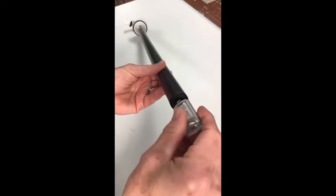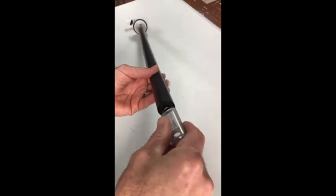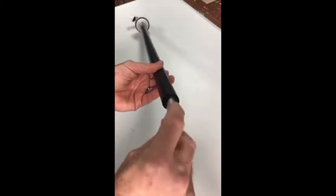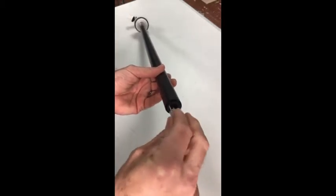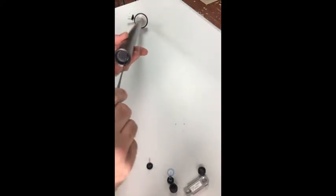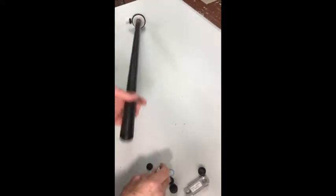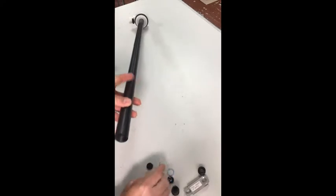You'll have a screen in there, and I've just got a mending brace, 3/4 of an inch mending brace, or a nickel will take this piece out as well. So we'll just unscrew it, and oops, that reveals the screen inside. And so we'll take out the screen. That's a 17 mesh screen. Keeps the debris out of your pump, so you don't have to prime it unnecessarily.